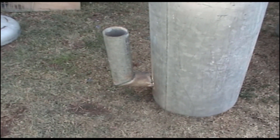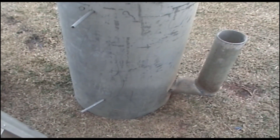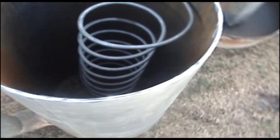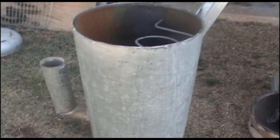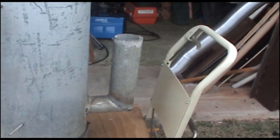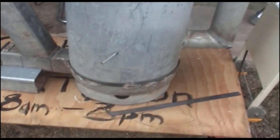I've welded my chimney on for the smoke to come out, and drilled a couple of holes in the side for my water pipe to go through. Don't forget - it's stainless steel, I wouldn't use anything else. What I'm going to do now is bend that over, fit it into the center, sit that piece back on top of my firebox, and weld some nuts and bolts on the bottom to tie it down. The smoke pipe is welded in and finished, and the cylinder is sitting back on the firebox.